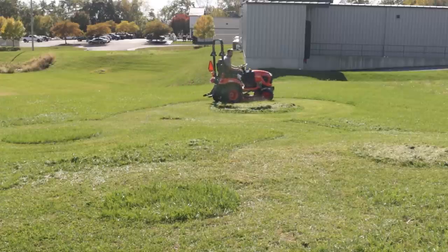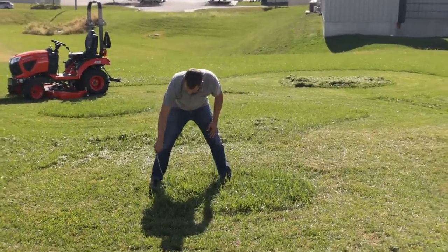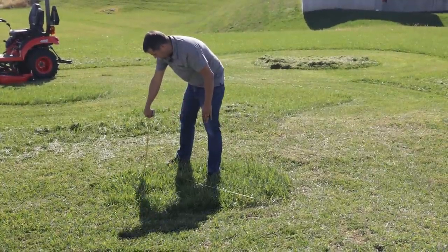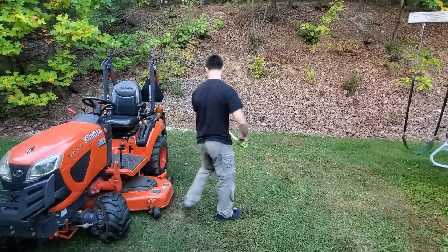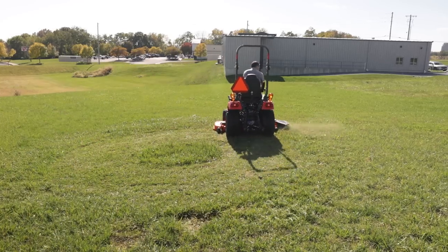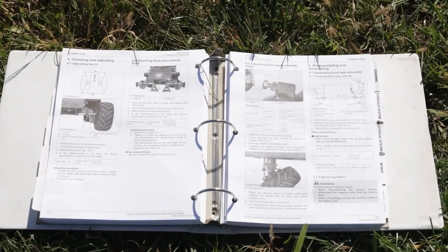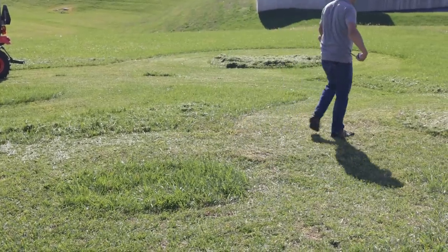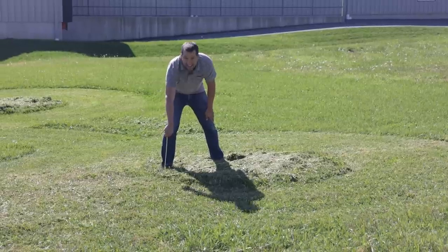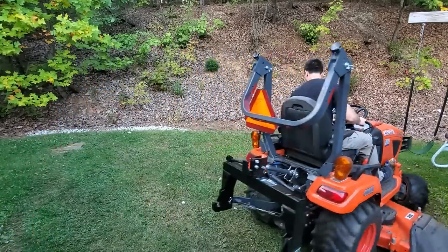The results here are just fascinating. Taking our smaller circle of grass and measuring end to end - remember Brian was at 60 to 62 inches - I am right there as well, about 60 across one measurement and 62 across the other, agreeing with what he came up with almost exactly. But where this got even more interesting: I did this test clockwise but also counterclockwise. Reading through the service manual, some of these stop adjustments actually indicate the tractor might turn sharper in one direction than the other, which is why I did both directions. Coming over to measure the other circle of grass, I got 82 inches - just like Tim did. So my first reaction was: did Brian drive one direction and Tim drive the other? Because these measurements matched spot on. But we went back and reviewed Tim's video, and in fact both of them were driving in the same direction. So Tim's steering stops must be adjusted wrong.